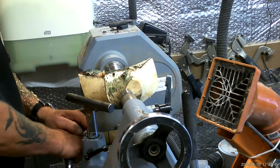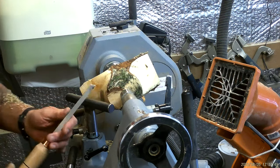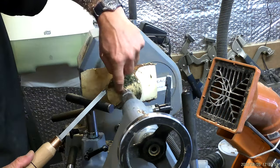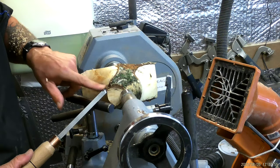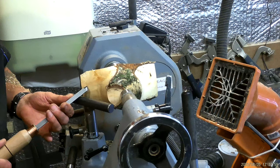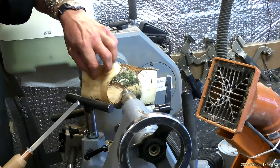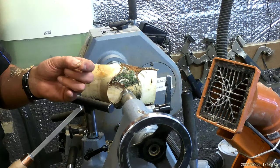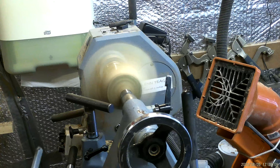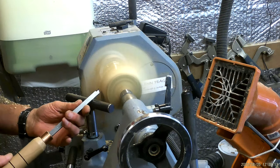So we'll put the tool rest that side of the handle so that I can drop the tool. And like I said, I've got the tool down, you can see where centre is, you see how much above centre I am. I'm cutting up here like this, coming round here. Like you can see, look, I'm actually cutting. Right, let's get it going again. Stand out of the way because I'm restarting it. Not that I've touched anything, but you don't know.